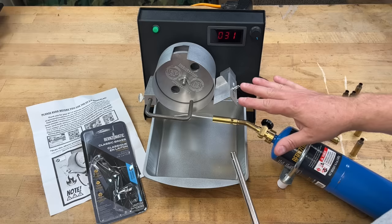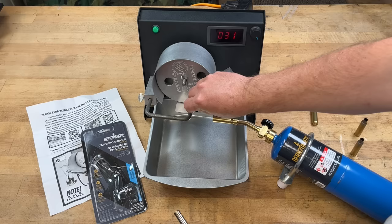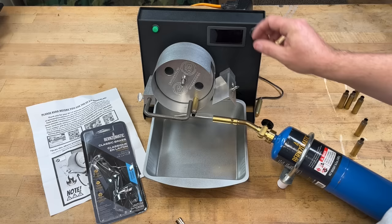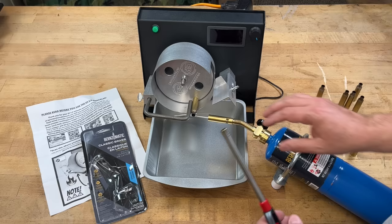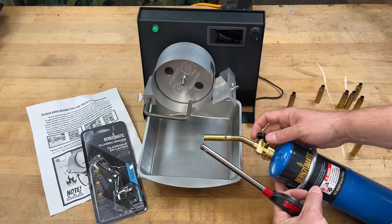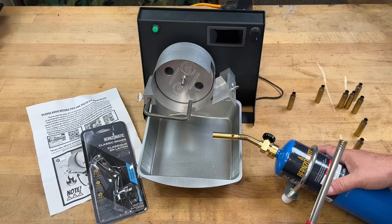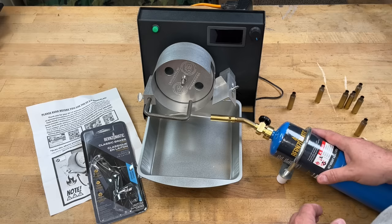He says that with most mid-range rifle brass you're looking at somewhere in the high 20s to low 30s as a good starting point on the speed setting. I'll stop the machine to make sure the flame is about where we want it, then turn it on. We want to get just a nice blue flame going. Keep in mind this bar is going to get very hot.